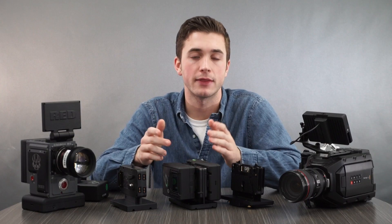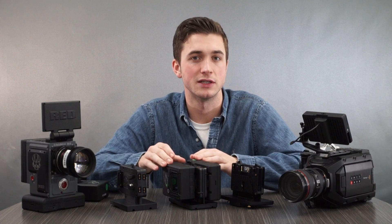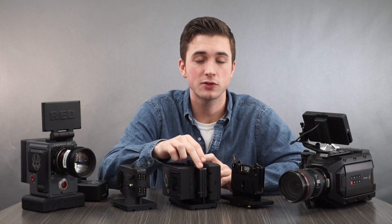Lastly, keep in mind that the hot swap or shark fin plate monitors the voltage of both of your packs. While the packs are in operation, based on battery physics, you will get an average voltage between the two. If one pack is fully depleted, the hot swap's internal circuitry will shut down that side of the mount, and then you'll be running off of one pack.